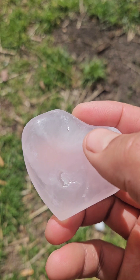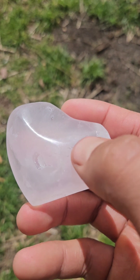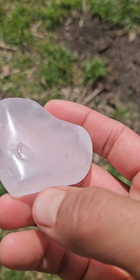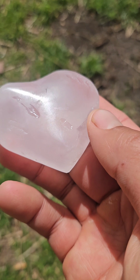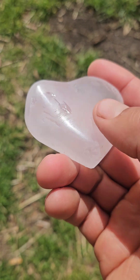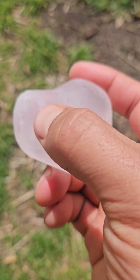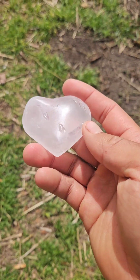I don't know which grit that scratch happened on, but it should look all uniform and even. Some areas you can tell are smoothed out to 3000 — those are the ones at the highest point. Some that are divoted in here still have scratches. Working with 3000 grit, it might take days to buff those out. It would be nice to know exactly what grit those scratches are at — whether 800, 1000, or 1500 — because then I could work at that stage and get the surrounding area down before moving up to a higher stage.